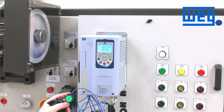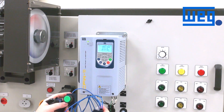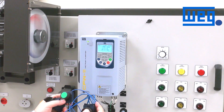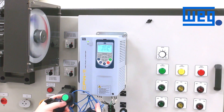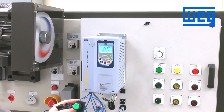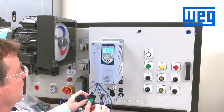To slow down the speed of the drive, we press the decrease EP. This is a normally open decrease and normally open increase. If we push the decrease, the unit will start slowing down. Speed up — release — stay at that speed. Slow down — release — and stay at the speed at which you released. Give a stop command, and the drive will stop.